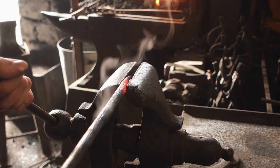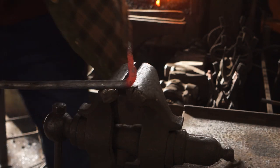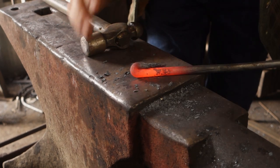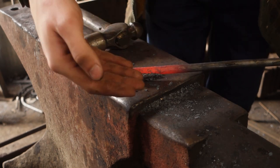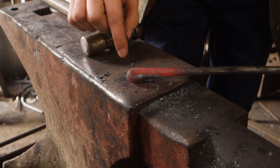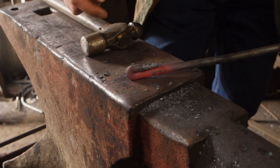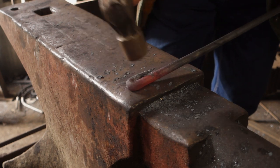I've got a nice short heat and I've clamped about half an inch in the vise. Make around, go around for the first bend. We can close that up on the end. What I want to do is to seal these sides — you can see that we have two round bars coming together, so we have a valley in between the bars. If I were to forge weld this, we'd still have a line there, or it would require a lot of forging to get rid of that seam. To get around that, I just weld it shut — weld both sides, then come back at a high forge welding heat, just check the sides back, clamping them all back, making it nice and solid.